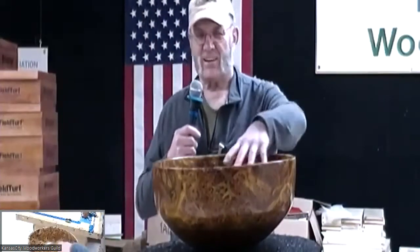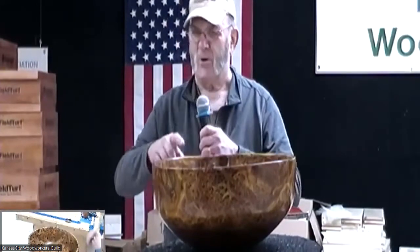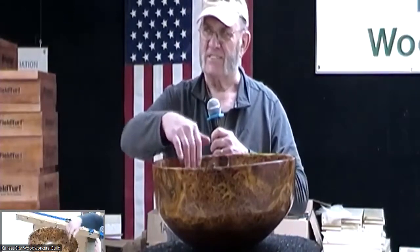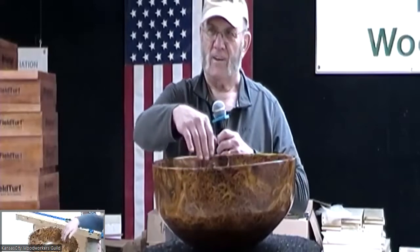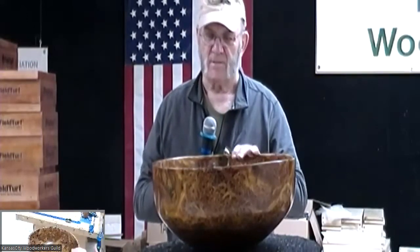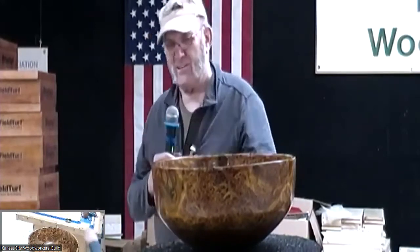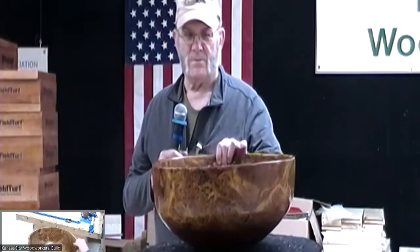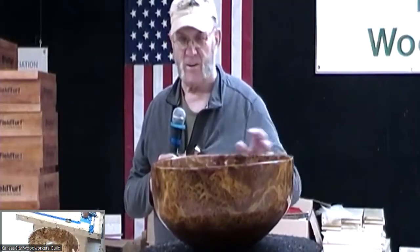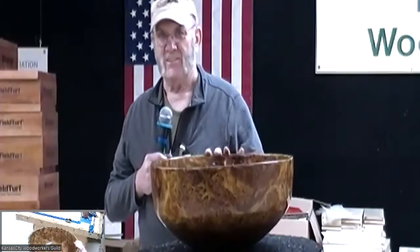But since I cored it, I have bowl number 2. This is 18, that one is 16 inches, and hopefully I can go by inch steps. The burl seems to be pretty stable. I didn't mean it takes so long, but happy to entertain questions. But anyway, like I said, pick the burl carefully, because if it is not a good solid piece, I wouldn't recommend you doing this.